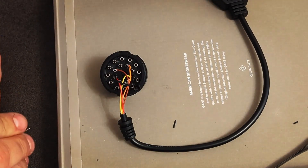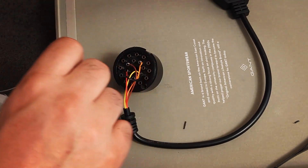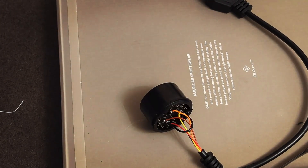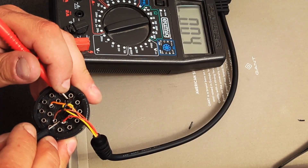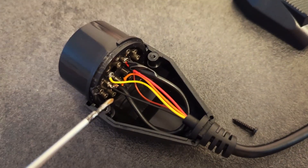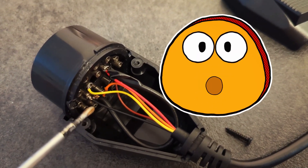I'm putting a little bit more solder on it just to be sure. It seems to be connected — I'll measure it to check. I have to backtrack a bit because I made a mistake: I accidentally jumpered pin 19 to pin 14 instead of pin 18 to pin 14. I only realized it when I was finished, so I had to redo the whole thing.